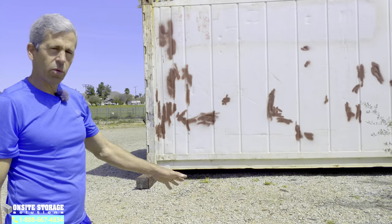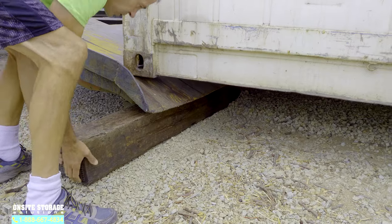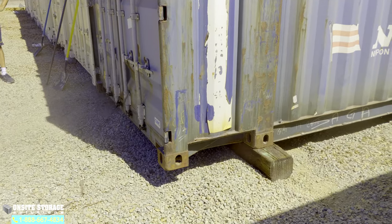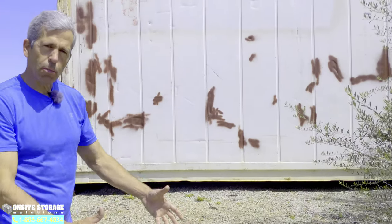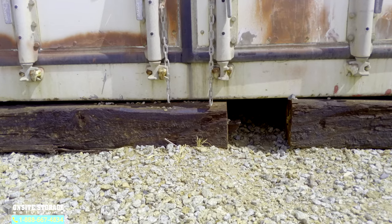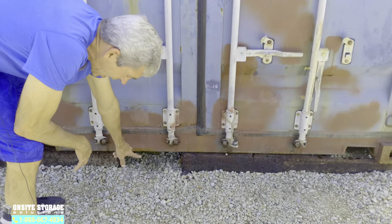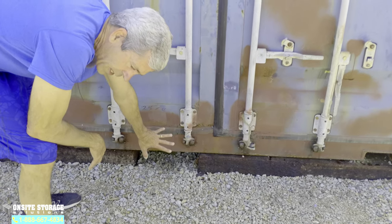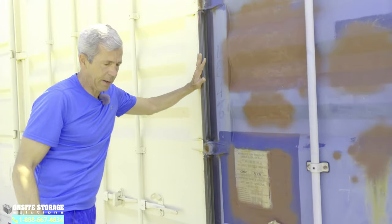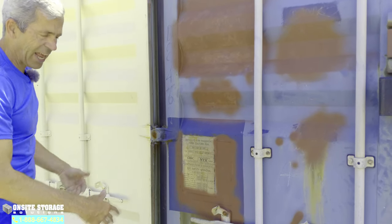When you place them — on the leading edge and on the last one as the container falls off the truck — it's highly suggested that you cut the tie in half. That gives you the ability to move it and have access to the center of the container if you need to adjust the doors. What we did in this case is cut it in half, which allowed us to put a bottle jack there to adjust the doors properly. If the tie is butted up against the container full-length, you don't have access to it, so cutting it in half makes it much easier.